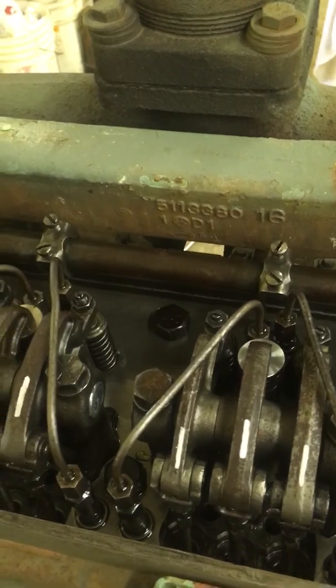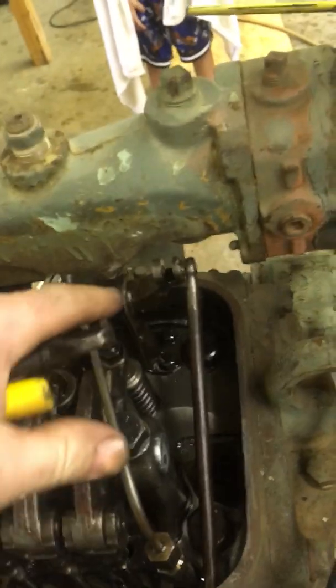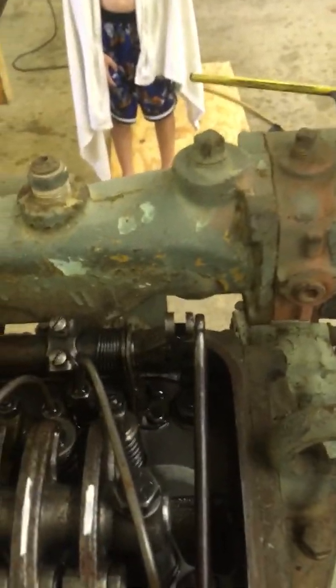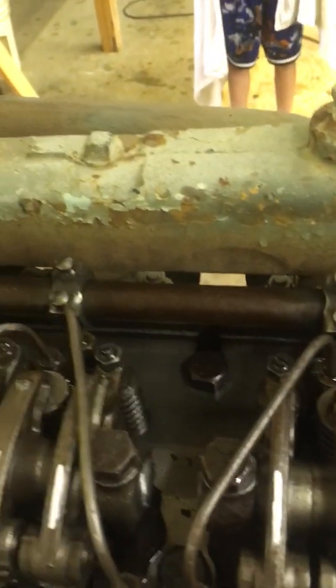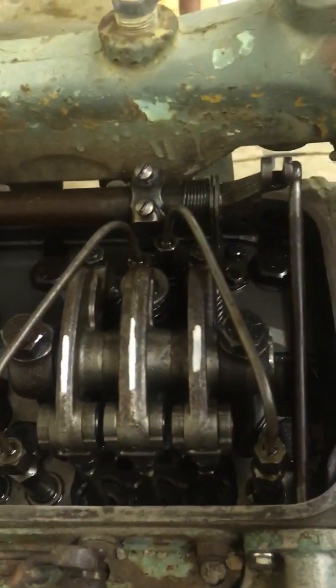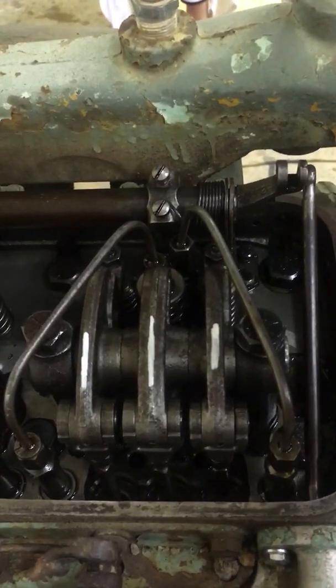Been there, done that. So come over here and put it on your clevis — that way you don't get any flex in your tube. With this old style rack you can do this one-handed, so you keep one hand on the vice grips, just not a huge amount of force but just keep it over there, and then you can run the screws with your other hand and keep checking it as you go down the line.